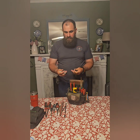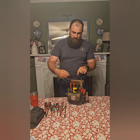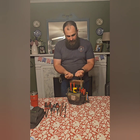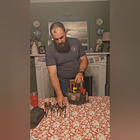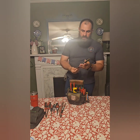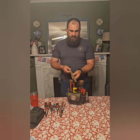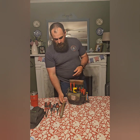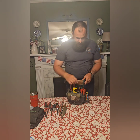A Sharpie is important for when I'm using a slip fix or measuring pipe — extend that sucker all the way out, put a mark around it, make sure when I put it in and extend it out and lock and glue it in, I know it's at full extension and it's not going to leak on me. If I ever have to use one of the knock-on style couplings, it's always good to chamfer the edge of the pipe down so the seals fit over it nice and easy. I've got a two-sided file there and a little bit smaller one as well.